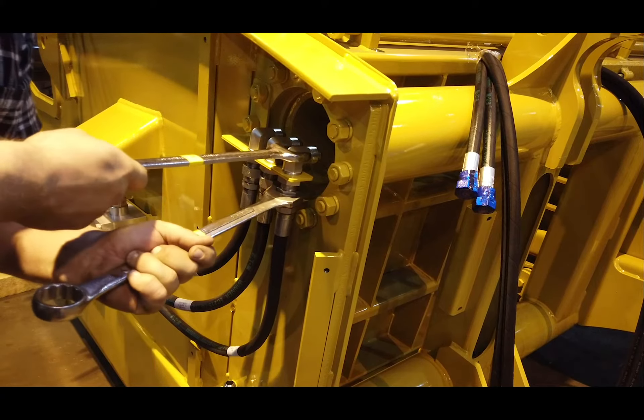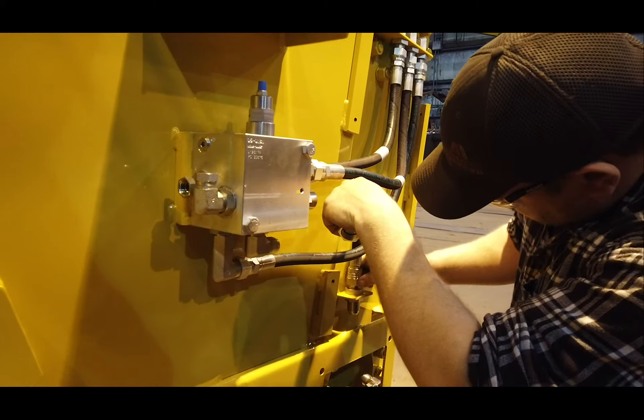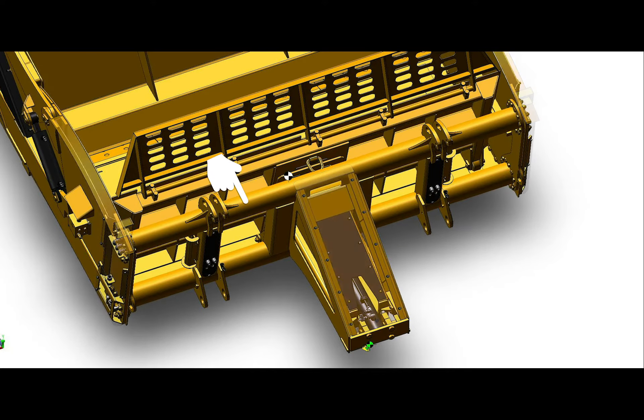Like the others, fully tighten before moving on. Now connect a number 11, Feed to Valve hose to valve port A, which is connected to the vertical bulkhead fitting. The next step is we're going to run the hydraulic lines through the top tube of the rear frame.